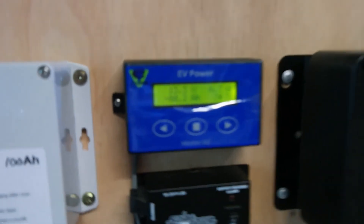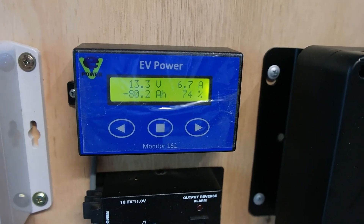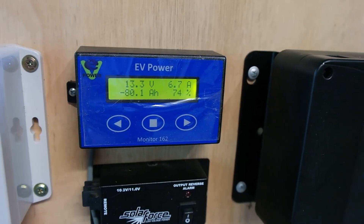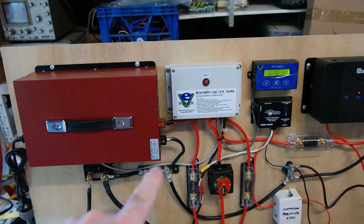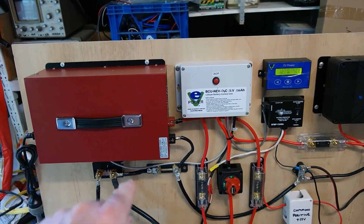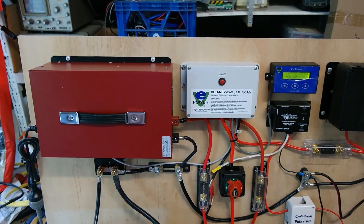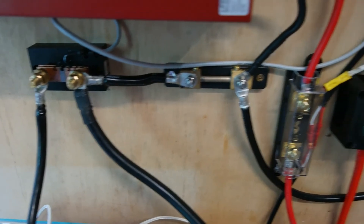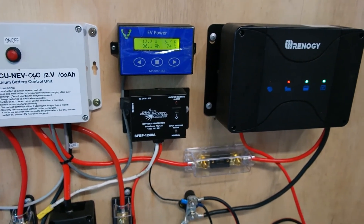As you can see, that's producing 6.7 amps. I discharged the battery last night as a good baseline. This lithium system was about two and a half grand, including the battery, controller, panel meter, and current shunts — one in here and one for monitoring from inside the van. They're both quite large current shunt units.